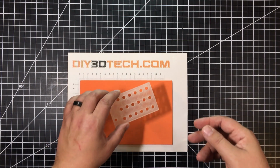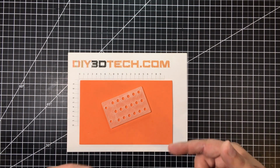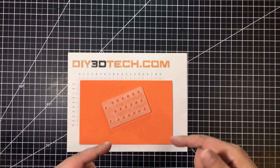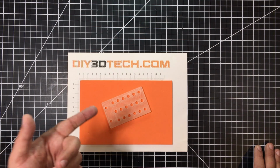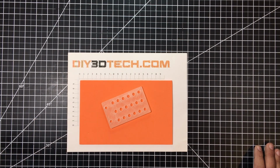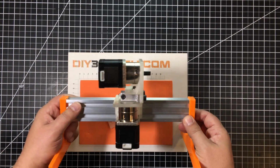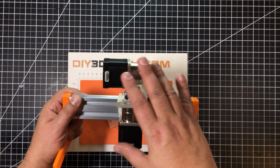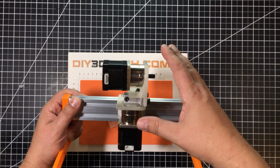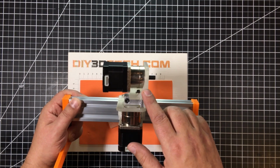Now, as I pointed out in the first video, the reason that I use surface layers is I do not want infill voids. And that is what infill does. Even at 100%, you run the risk of voids in your model. And I did not want that. Because as in my first video, I had these guys. And you can see they're taking a lot of weight, supporting both of these motors and a platform. It needs to be super rigid, and these are also solid pieces of plastic.